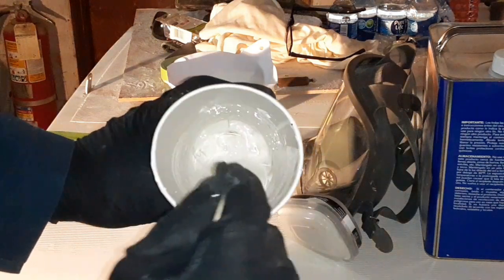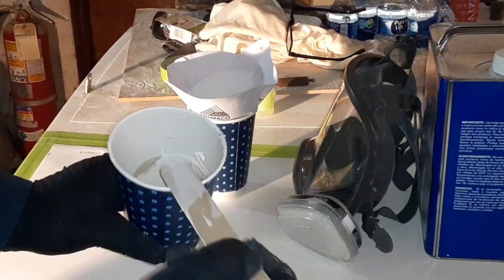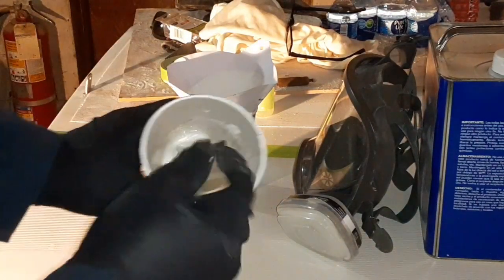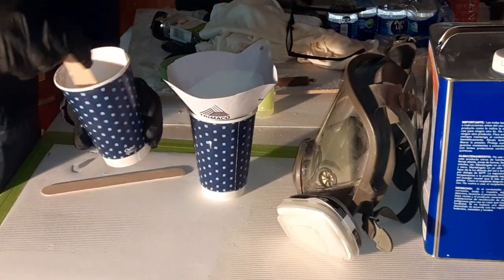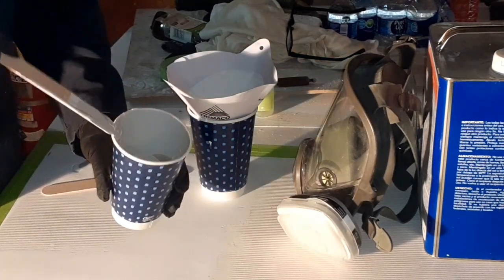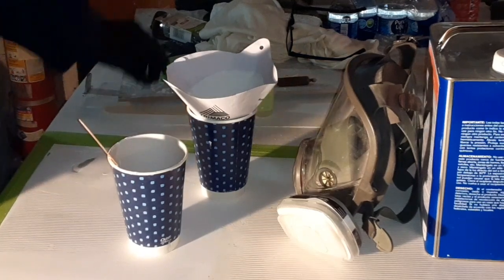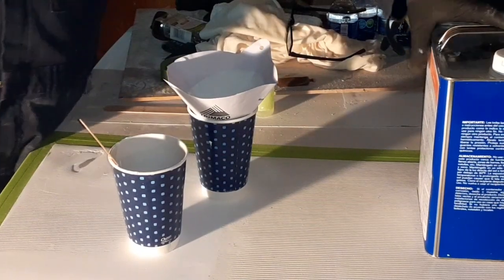Then I will add the darker medium into a separate cup of white gel coat, and this will give me my slight tint. I'm trying to make enough pigment in a cup by mixing the gel coat and the pigment together. What this will give us is a color to add — I can add it by measuring or by sight — and I can match the color of the existing gel coat surface on the deck.